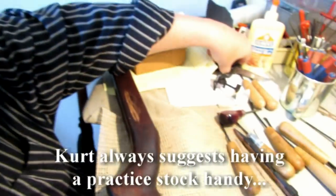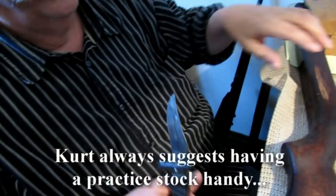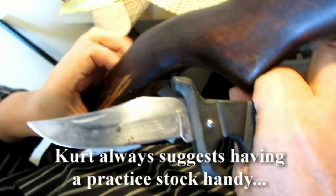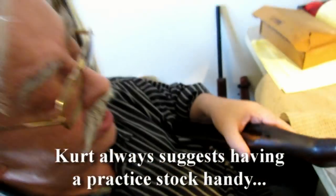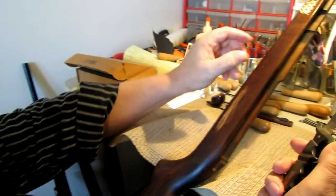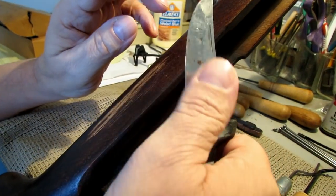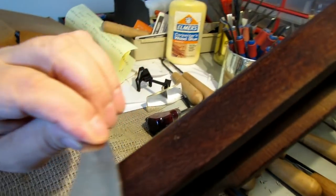There's a more efficient way of doing this — much quicker, more efficient — and especially when you have a fairly heavy coat between the finish and the stain. Simply use a knife as a scraper, a relatively sharp knife with a smooth blade on it. You scrape with the grain.